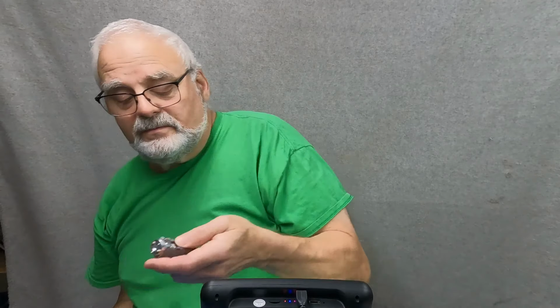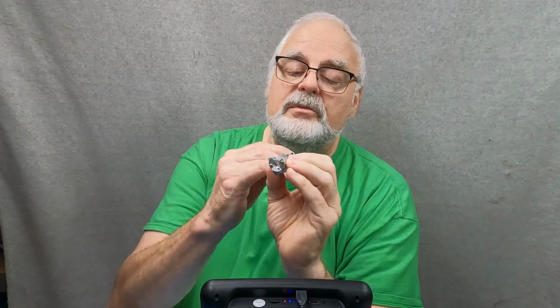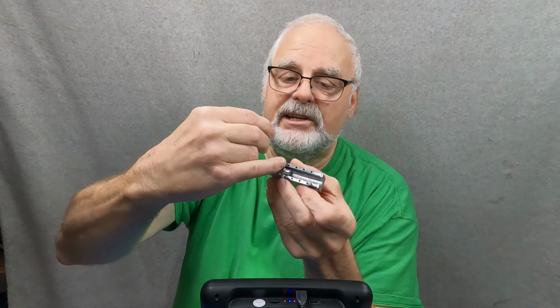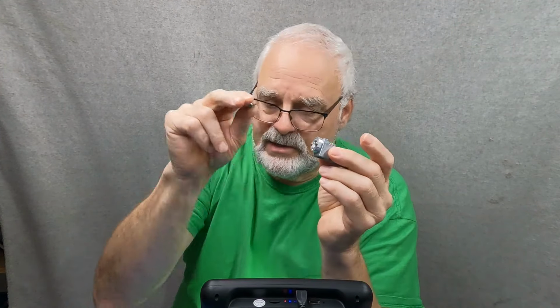So we're going to pop up here. And you guys have seen these things, right? Maybe not. I don't know. How many of you ever took apart a laser printer just to get the precious laser diode? Well, this is what they call the sled. And it's adjustable. It's a big cast aluminum piece that's machined out. There's a lens arrangement in here that focuses this, which is the laser diode. And it normally fits right in the back, and this focuses to a point so that you can write with the laser. So let's take a look at just the laser diode itself.